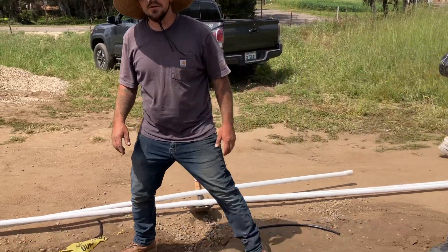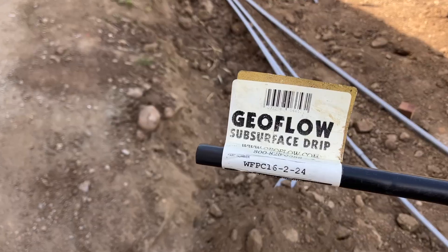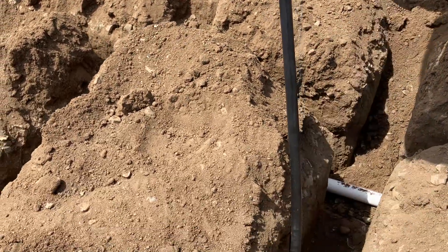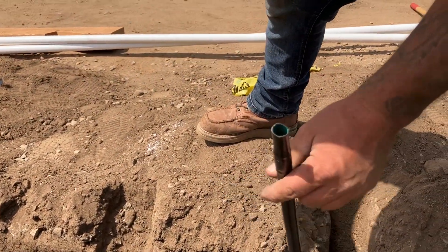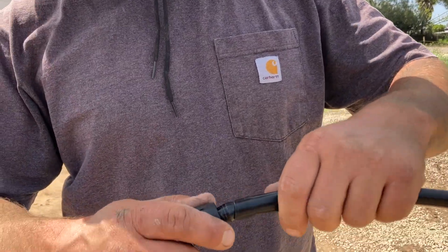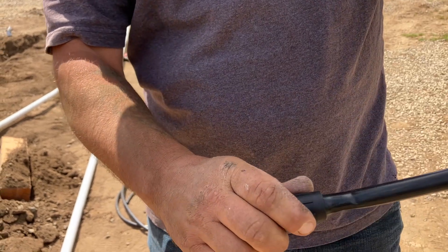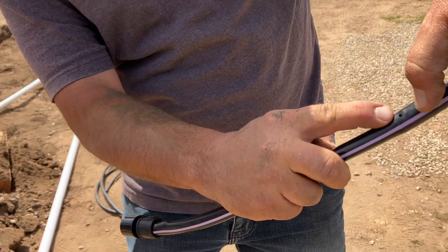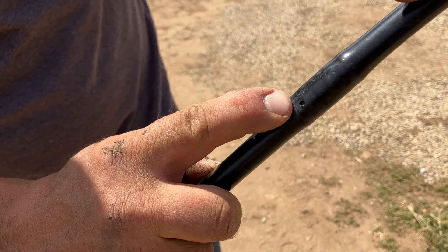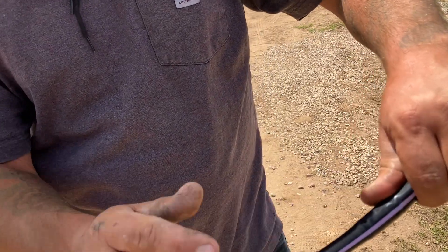It's approximately 2,200 feet of drip line. This line looks similar to standard irrigation drip line, however it's slightly different for this application. Every two feet there's an emitter where water is forced out via the pump. Here are the special fittings and pipe that we use — it just goes on like that, twist locks out, and that fitting is secured to the pipe. Here are the little emitters that are every two feet. There's a tiny little hole — that's every two feet inside the trench here.